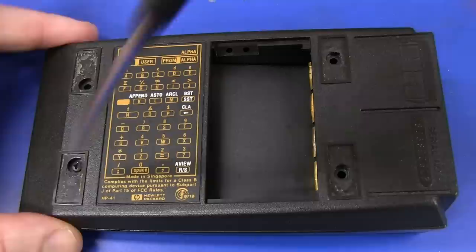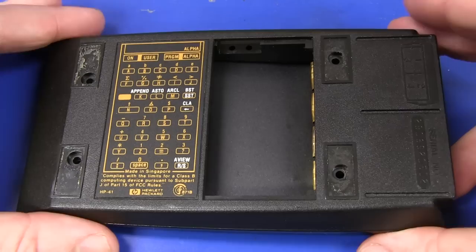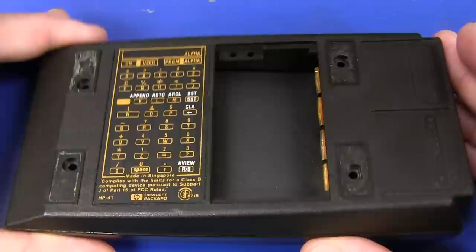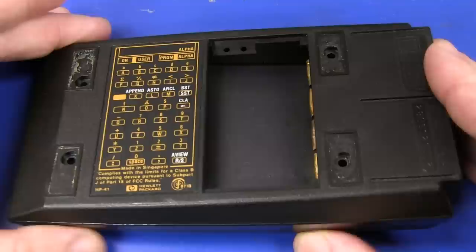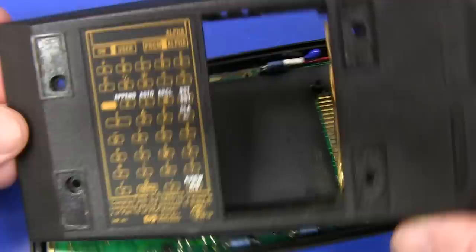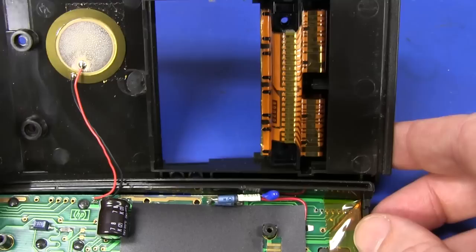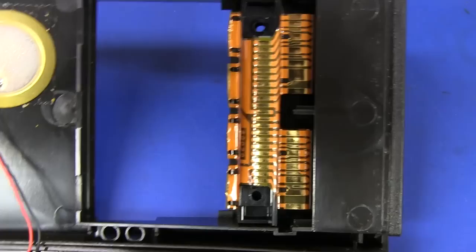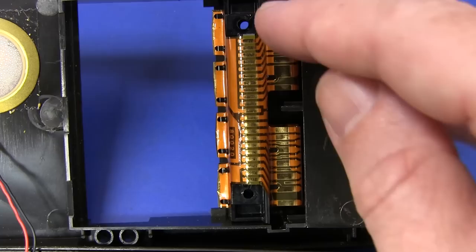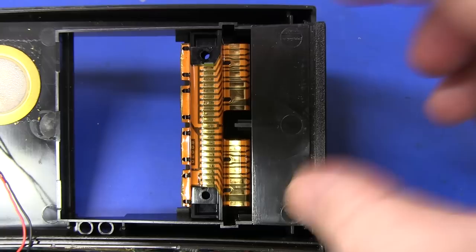The 14-segment LCD was an innovation in its day. There are tiny little screws at the front. It's going to have almost maybe all SMD — I'm not sure if it's going to be a full flex PCB. It could have the main custom processor mounted on the flat flex. But it could very well be standard FR4 — yeah, standard rigid PCB. There we go, just some pressure contacts down in there, and there's the flat flex up there for the expansion. It's just relying on the pressure of the case from where the screws are. They strategically put the screws right next to the connector there, so it just makes contact with the gold pads down there on the board. Some thought went into that.